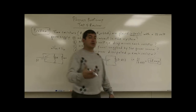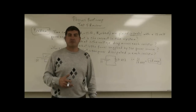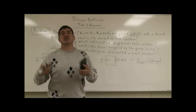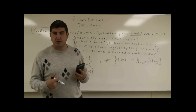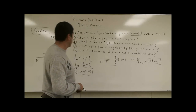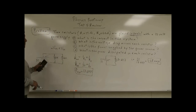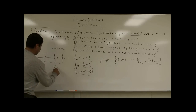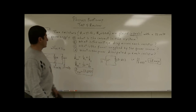That's actually more current than in series. One thing we learn from this problem is that you draw more current from a battery when resistors are in parallel — you use the battery more to its full potential. As for the voltage drop across each resistor in parallel, both are going to be the same: 12 volts across each one.